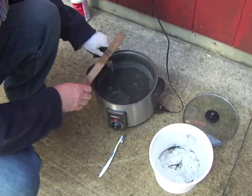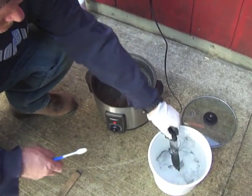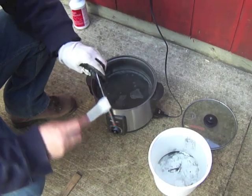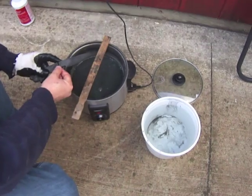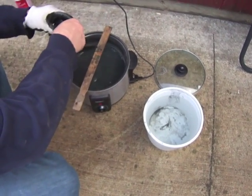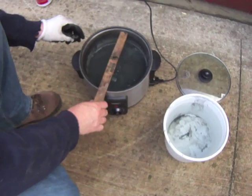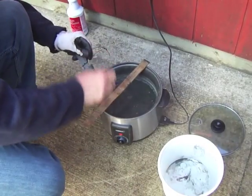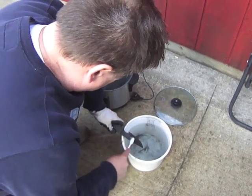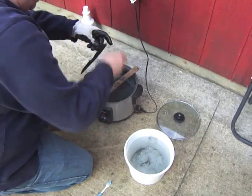After the part has soaked for about 15 minutes, I take it out and immediately dunk it into cold water. Then I take this old toothbrush with nylon bristles and just carefully and gently brush off the oxide. I'll rinse it off, and it goes back in the solution. After 15 more minutes I take it out for the second round and repeat the process, keeping this up about five or six times until I get a good black color that I like.